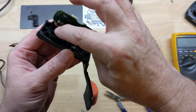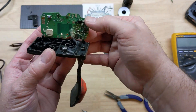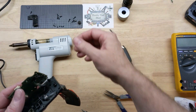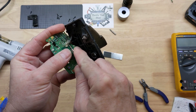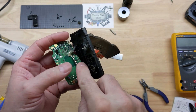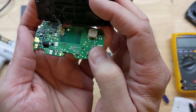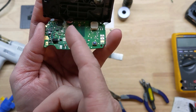There's our push button housing, the rubber protector and sealer. And that's the connection we're trying to get to on the board right there. We just have to work away very carefully with the silicone to get to our solder connection — be careful, because as you can see there are a lot of SMD components all around it, especially on this side.